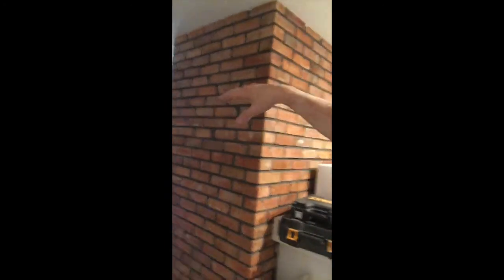And then I use this rubber donut. It catches a lot of my dust. It'll actually fold as I compress into it, and it's really a lifesaver on dust and debris. But that's how I drill my holes, because then they'll go through and remud those holes. These guys are actually going to scrape this whole ceiling because it's just a mess all the way through. So they said, I don't care how many holes, just make it right.